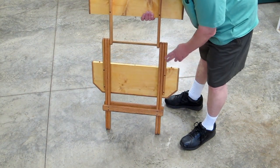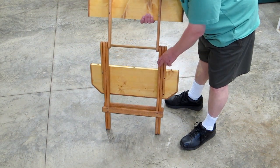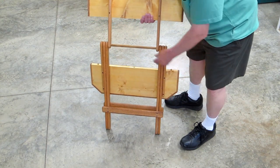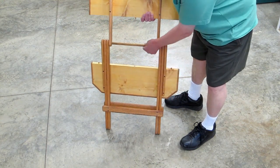Very straightforward construction: straight slats, round over the ends, round the edges with the router table, a few sharp pieces of dowel rod, and one for a handle.